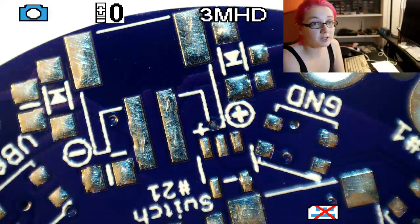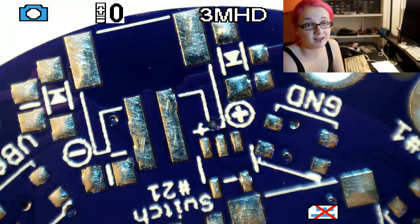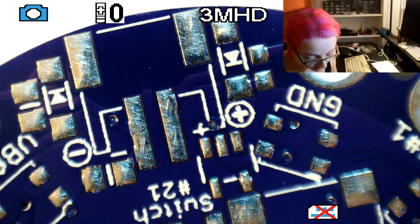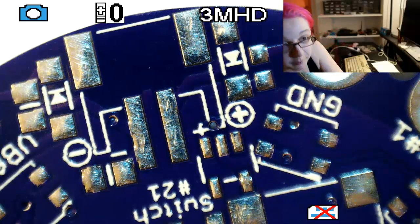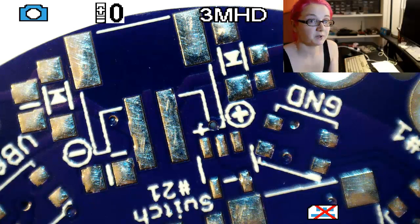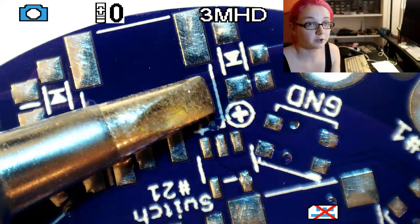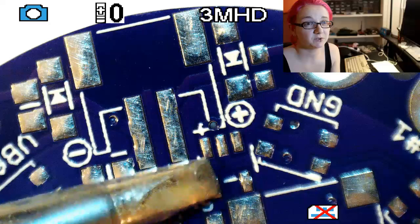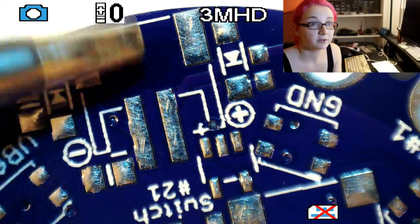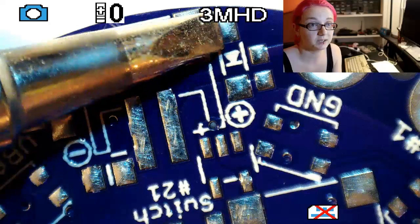This is that model. At work, I use a Metcal. It's got fast removable tips. It's kind of hardcore. It heats up really fast. That said, you can switch tips on this. For example, this is a large tip. You can see this is a little bit too big for some of the pads I'm talking about here. This is really good for through-hole stuff or big heat sinks.